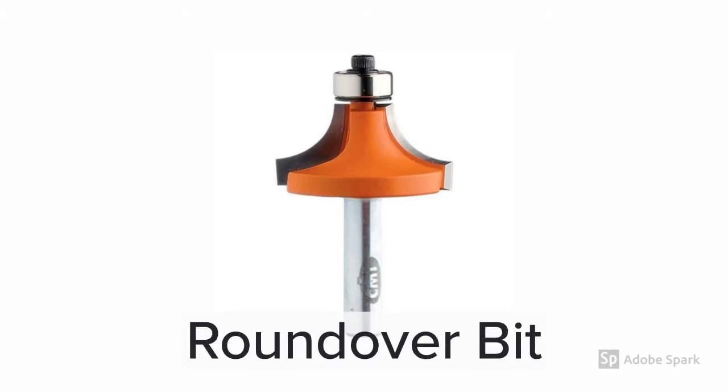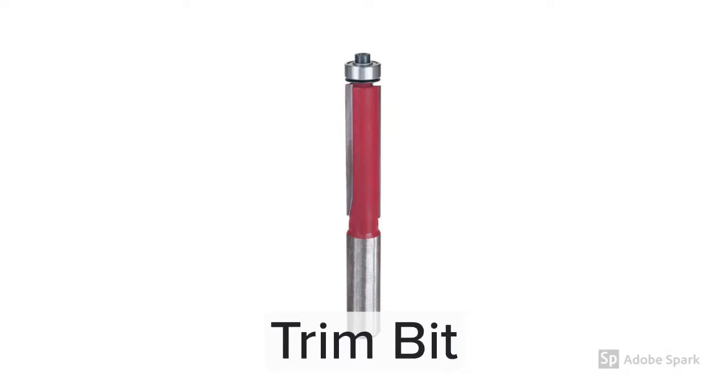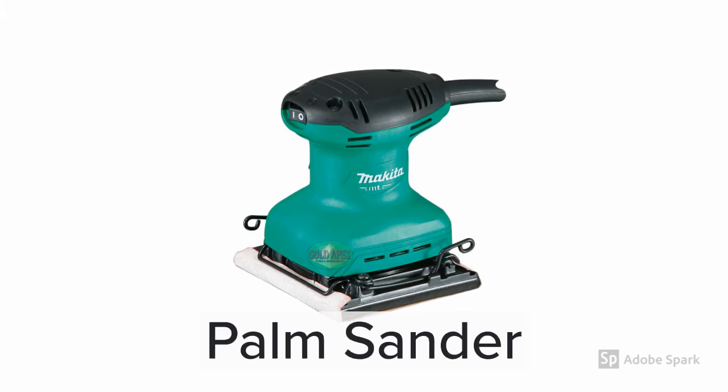This is the round over bit. I chose to use a round over because it's simple and comfortable to rest your arms on, but if you wanted a more detailed edge, you could go with something like a cove bit as well. The trim bit is designed to run along a guide to make accurate cuts. With this project, we end up creating a guide by accident by creating the TV frame, making it really easy to cut that opening. The palm sander is another common household tool, used mainly for speed — you could hand sand if you want. I use sandpaper grits from 60 to 220 on this project.